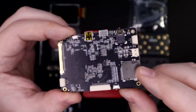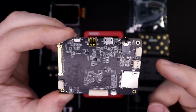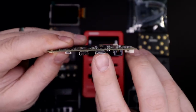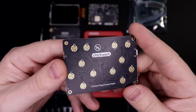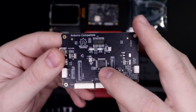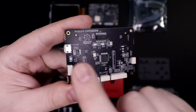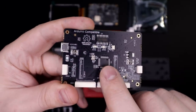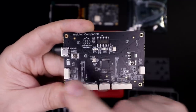There's a Wi-Fi and Bluetooth chip, and on the other side a microSD card slot, connector for the LCD, connectors for the battery and keypad, and on the top is the headphone jack, micro USB charging, micro HDMI, and power button. Here's the button board — on the other side is that ATmega chip, which you can reprogram as you would any Arduino using a micro USB port. You could use that to make peripherals with more buttons or sensors using the input pins.